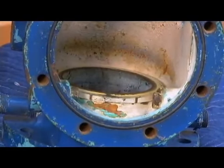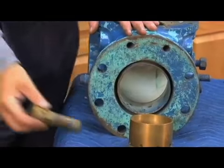This is what's called a quiet zone, or zone of quiescence, as Clavel called it. And the purpose of that area in here is that's where the sensing line for your high pressure sensing line came through. In other words, the nipple came through the side of the body right here. And that nipple, like this, would attach to the side with a fitting that would go to our high pressure sensing line.